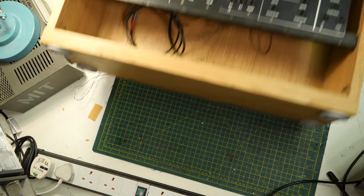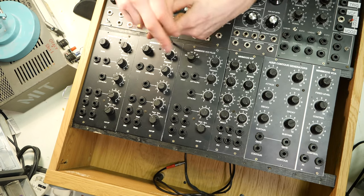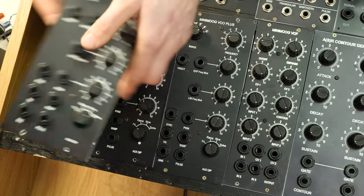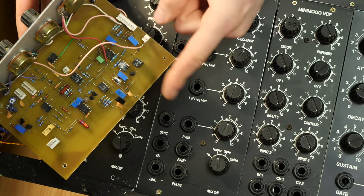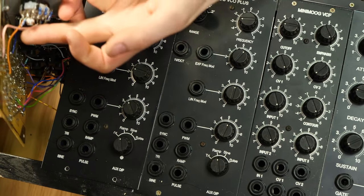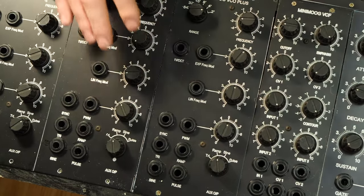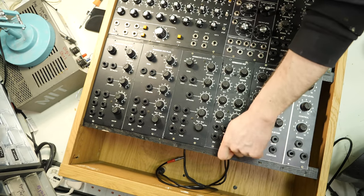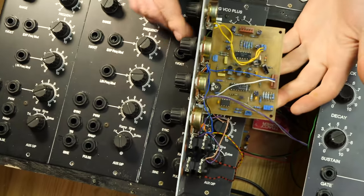So what's going on with this thing? We'll start on the bottom area, which was apparently built by a friend about 10 years ago. Wooden rails — none of this fancy stuff. The PCB has been self-drilled and this is meant to be styled after a traditional Minimoog-style oscillator. It looks like maybe it was built in something else first because it's got connectors, but those connectors aren't actually wired — all the actual connections have been directly soldered. You can see the temperature compensation resistor permanently coupled below. There are three of these lovingly made oscillators. Next to that is the Minimoog filter — it looks to be self-etched as well, so this is a self-etched Minimoog filter.